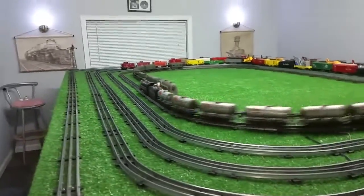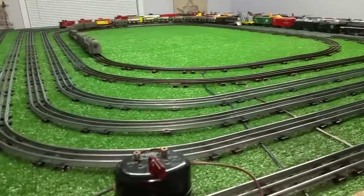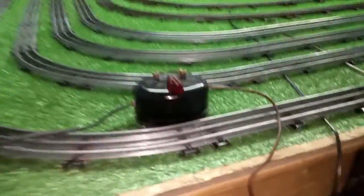We've basically taken two 25-watt transformers and converted them into one 50-watt transformer. You can take two 50-watt transformers and convert it to one 100-watt transformer. All you have to do is make sure that these two transformers are in phase.